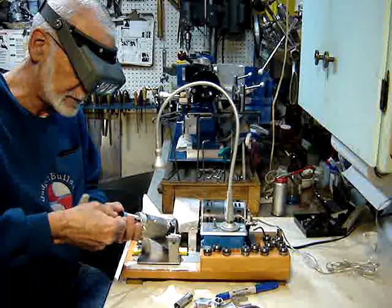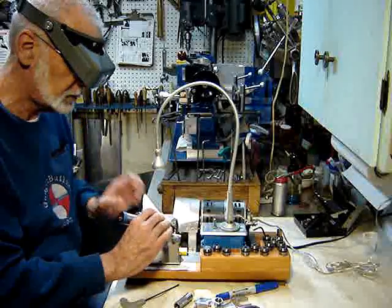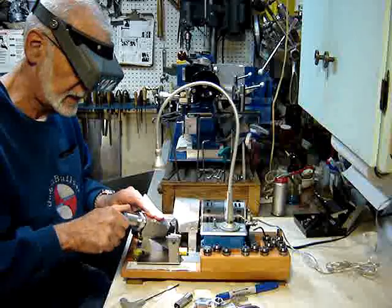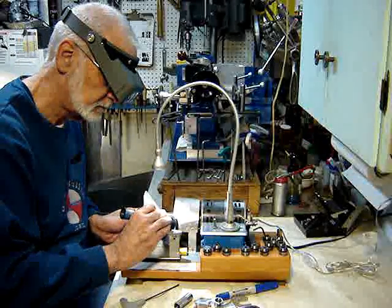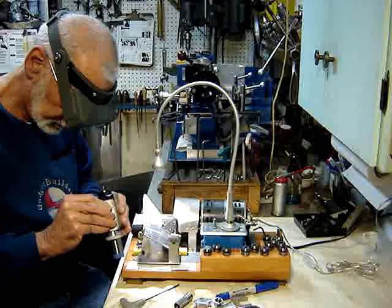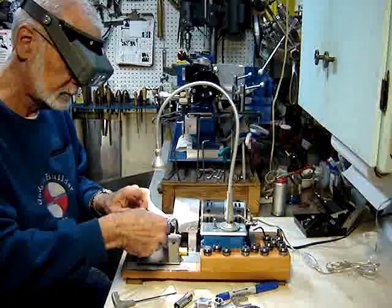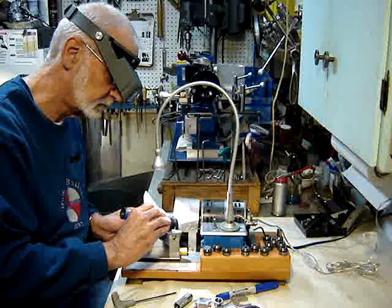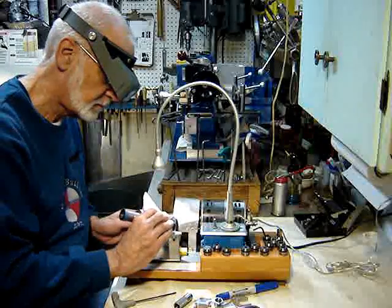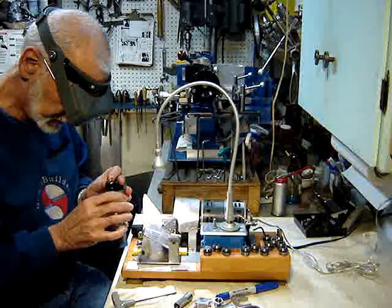So we infeed a little bit. You have to loosen the chuck — we've set the infeed but it hasn't dropped down until we loosen this. Then we go over to the other side and find the secondary facet again. That completes the secondary facet.